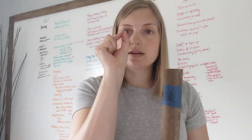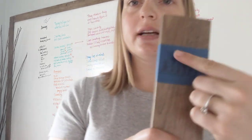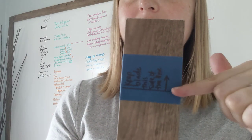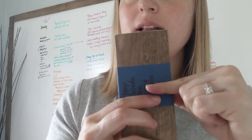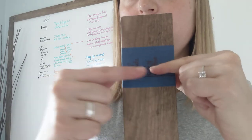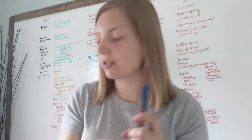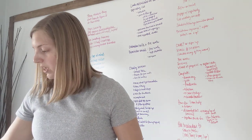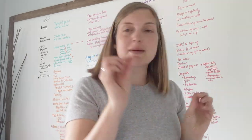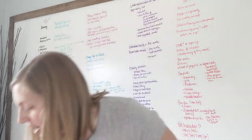One pro tip: the width of the blade is actually going to take away from the cut. What I like to do is draw a line and put the edge of the blade on the line with the good side I'm keeping facing away, so when it cuts through, the blade width is taken from the waste piece, not your finished piece. If you do this right, your cuts are going to be perfectly flush.